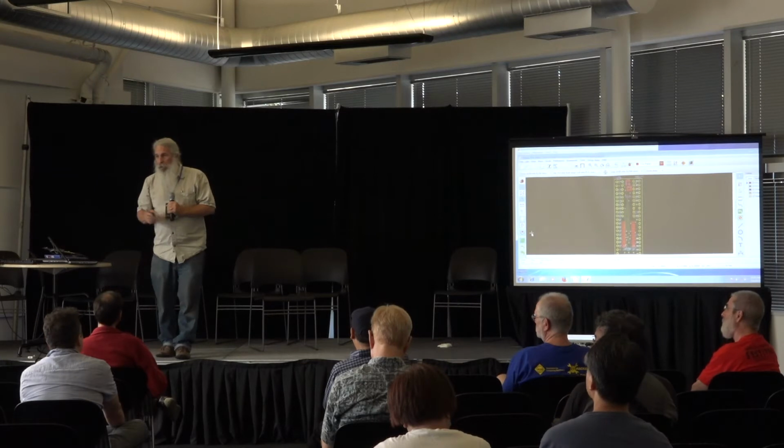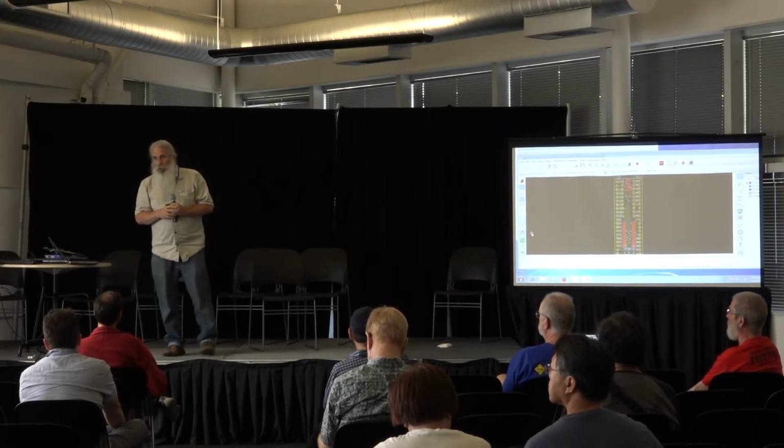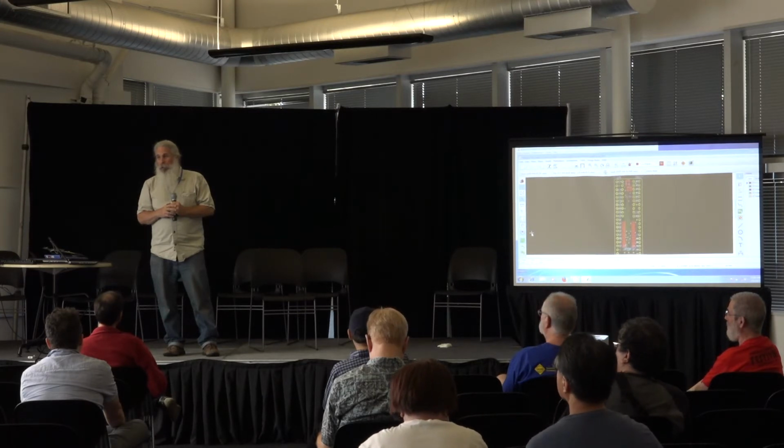Yes. Most of them are doing plated through holes now. They realize that two layers without plated through holes is kind of useless. You can do it, but it's really difficult. But yes, these are plated through holes.